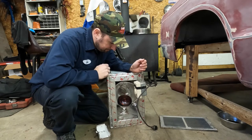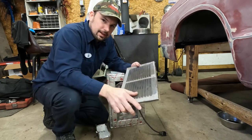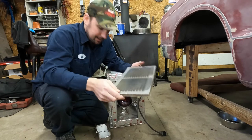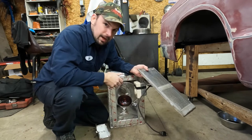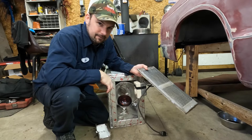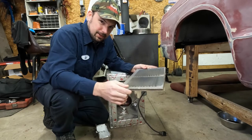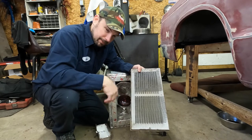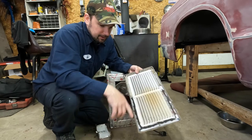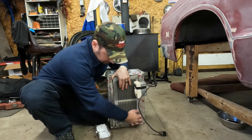I'll show you how we monitor inside the house and keep track of how hot the front of the unit gets. This is a standard cold air return but I've got a layer of aluminum screen on the outside to keep straw from getting inside — that was one of my biggest concerns. When I was testing the ceramic bulb I could actually put a piece of paper on top of it and it would start to smoke and catch fire. The 250-watt glass bulb did not do that. So I wrapped the screen around, glued it with silicone, and made a silicone gasket around it to make sure straw couldn't get shoved up in there.